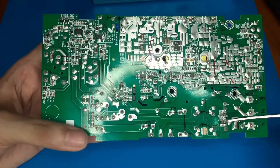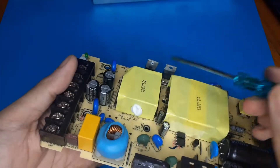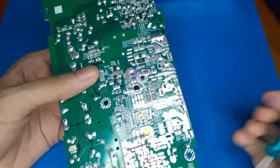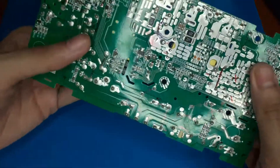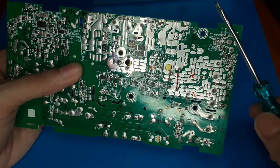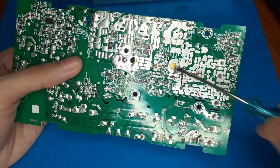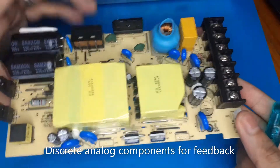There are obviously discharging resistors across the cap, which is fine. At the output we have two MUR2040 super fast recovery diodes, and they have their own snubbers across them - those haven't been omitted. On the secondary side there is no major IC as such; it's basically TL431s, various regulators, diodes, and other passives.